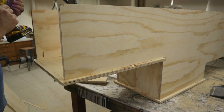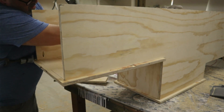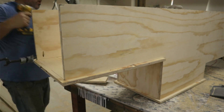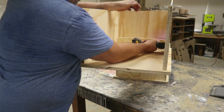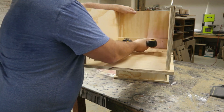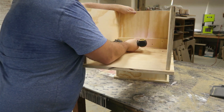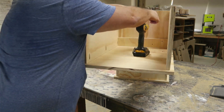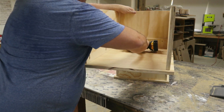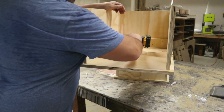The overall depth of these is 18 inches — that's what the top is. Because of the overhang the pieces are actually a little bit narrower than that, but the overall depth of the platform will be 18 inches. I took some cut-off pieces and made a little support piece on the inside of the two outer platforms. I realized there was nothing really supporting the platform in the middle where it met the highest platform, and with wrestling the biggest guys can be 285 pounds each, so I needed to beef it up a little bit. This may be over-engineering, but I thought better safe than sorry — I was going to throw the pieces away anyway since they're almost too small to use for anything else.